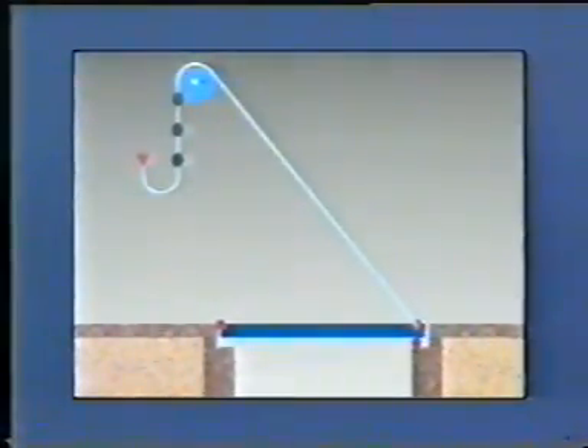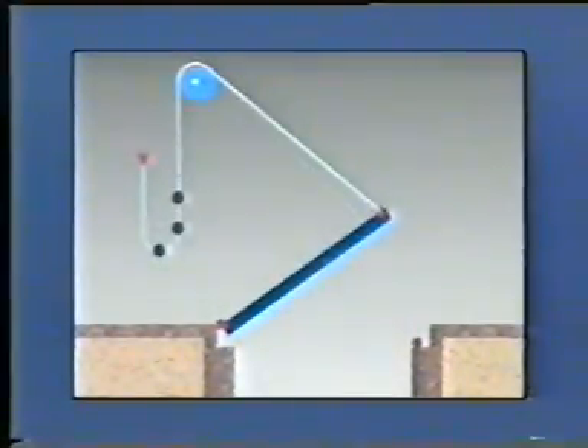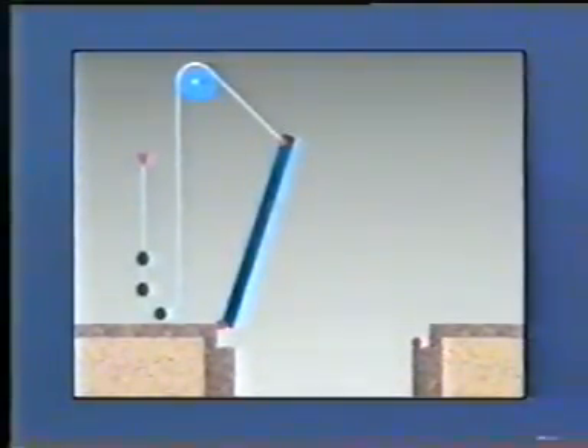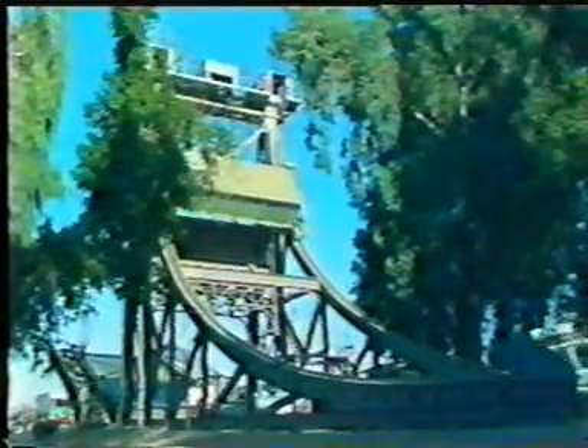To keep this acceleration under control, the counterweight was sectioned. While moving the bridge, the action of the counterweight is transmitted in parts to the point of suspension on the wall. In a discontinuous way, this was achieved by using metal balls. By rolling a counterweight along a curved track, continuous control was obtained.